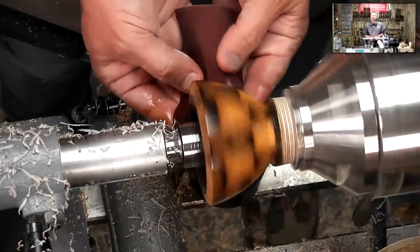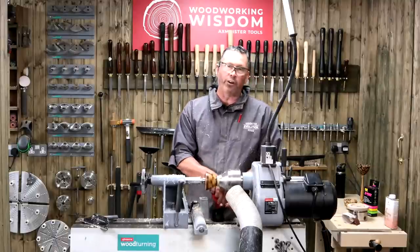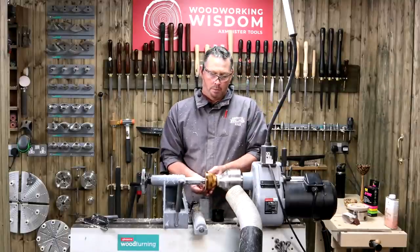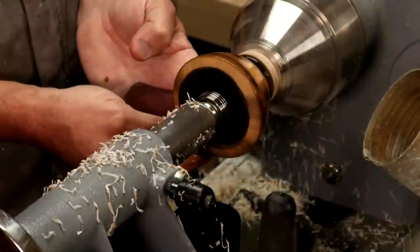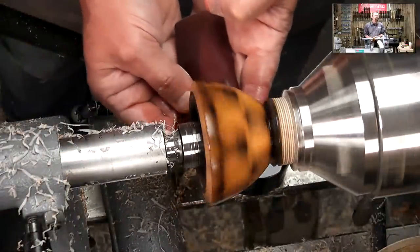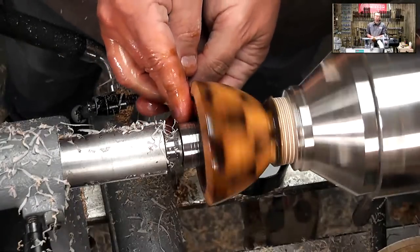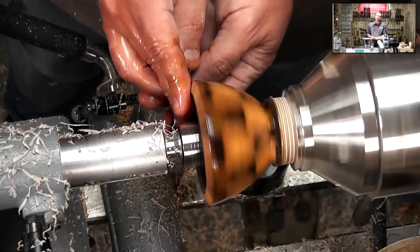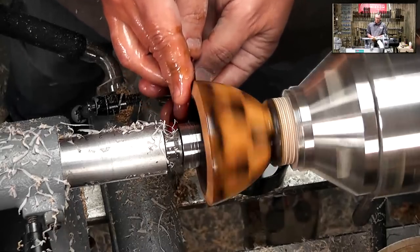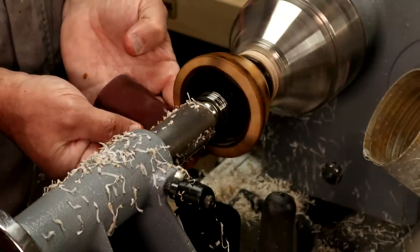Not really. And the reason being that you're going to be fighting lathe speed there. We can't have oil on the piece liquid whilst it's running at a cutting speed. The speed is going to be too fast and you'll have a face full of oil. It'll also be a really messy job as well. You can't go as slow as is required for oil because the chisels will grate and cause too much pressure on the workpiece. So it just won't work. Speed is your enemy on that, unfortunately.